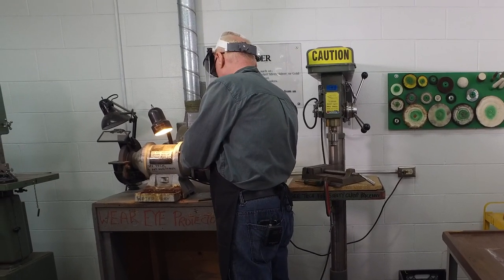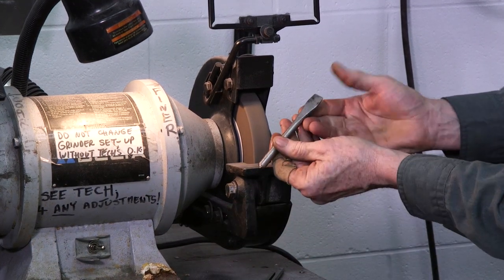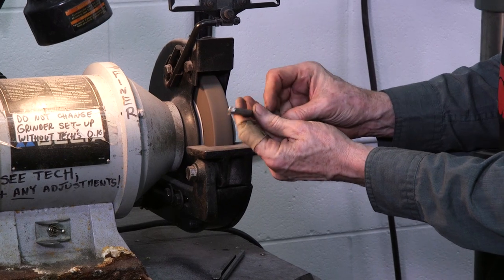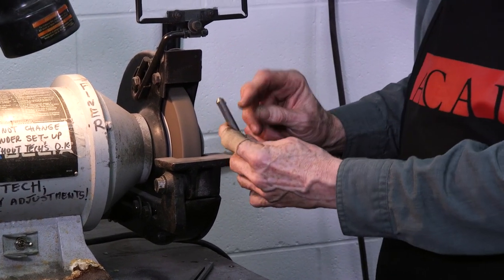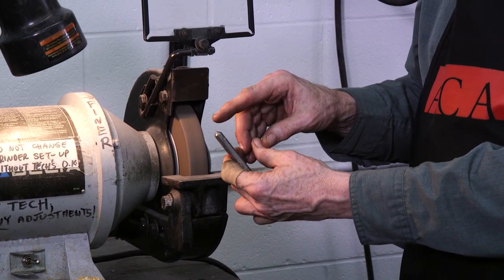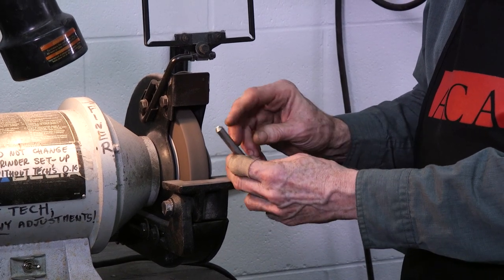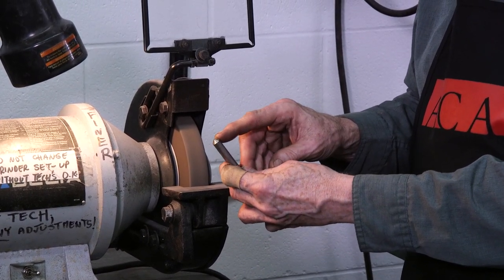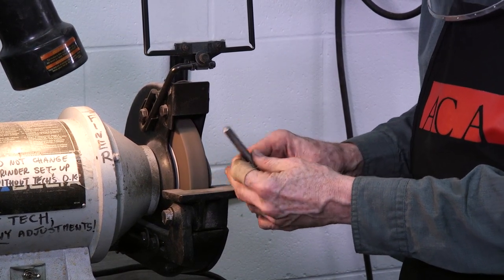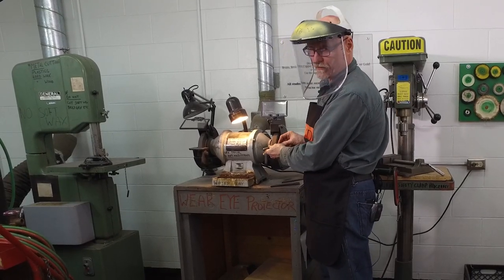At this point I'm going to cool it off a little bit more and grind the end a little flat. We now have the blank ready to produce our chasing tool. The only other thing I might be concerned about is making sure later on that I've heated this part until it discolors to a blue color. That means this will be soft so that when I hit it with a hammer it's not going to shatter and injure me. I think we're ready for the next step over at the sanding tool.